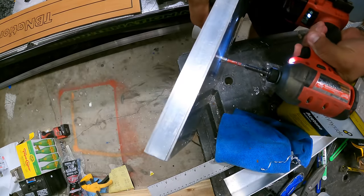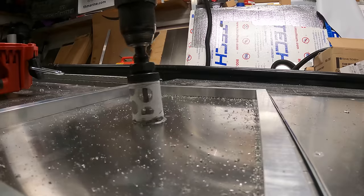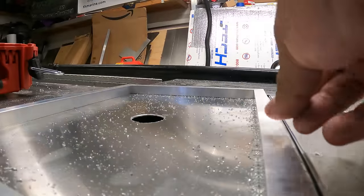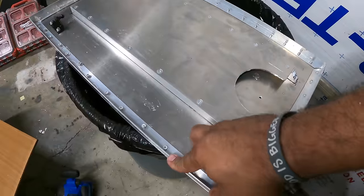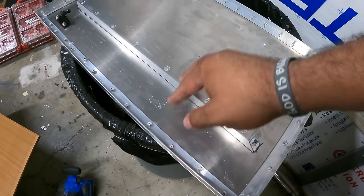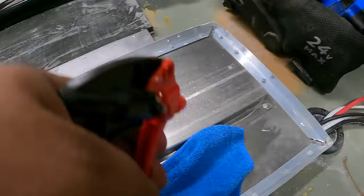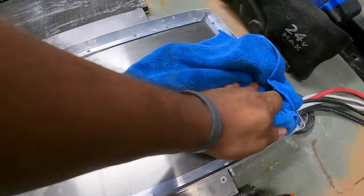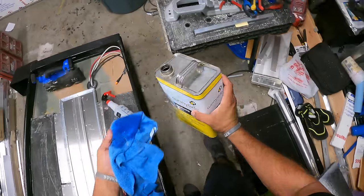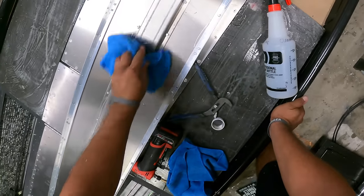If you're following this series, you saw that last episode we put together all the hatches. This is the Gen 7 core, and we also mixed in some Gen X core to make the entire thing work, along with Coosa Board side panels. We rigged it. It took a long time to do this DIY, but the fact is you can essentially make any kind of hatch you want without a welder. So out of your small garage, just like me, you can put a whole boat deck together. And so that's where we're at. Now we're prepping it and we are going to actually paint the exterior.